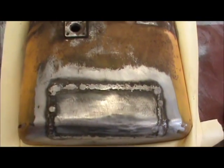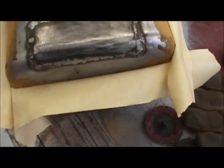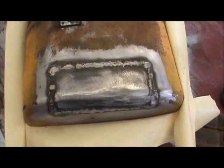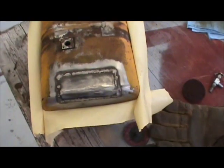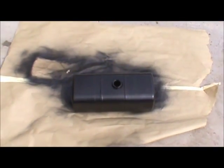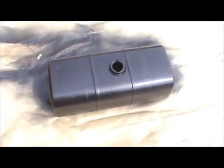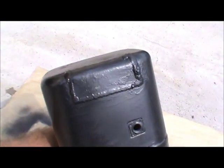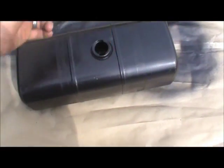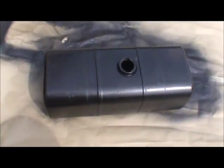There's the patch I put on. I got a pretty good weld all the way around it. As you can clearly see, I'm not really concerned about appearance — I'm not going for restoration, I'm going for functionality. I just want my tank to stop leaking. I decided to go ahead and spray bomb the whole thing black since it was turning into a two-tone thing that looked stupid. Like I said, I wasn't going for looks, just trying to get it sealed up — that's going to be plenty good enough to hold gas. I spray bombed it with some black rattle cans. Probably the first time I spill gas on it it'll wipe right off, but it's welded up to hold gas and that's really what I was trying to do.